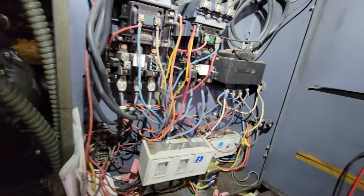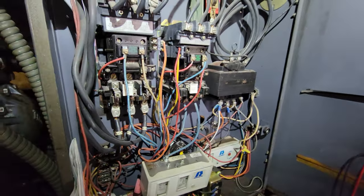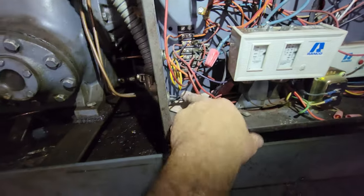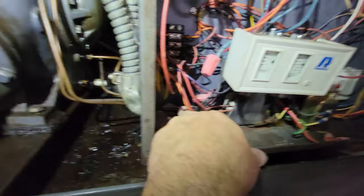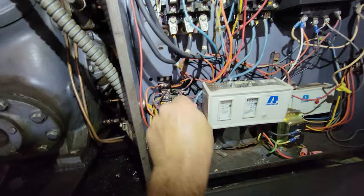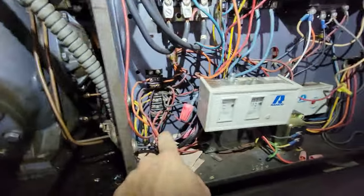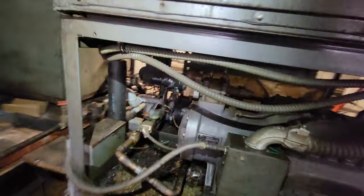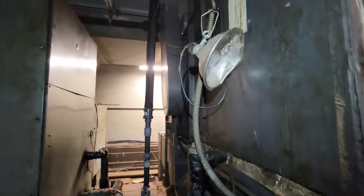It's going to take a while for that to cool down, so we'll have to check that voltage here in a second. While we're waiting, I went ahead and checked these wires here that are dead because the contactor is open right now, and all the rest of them are obviously live. We'll follow that up — it probably goes right over here to the motor, which is a freaking hazard trip zone here.